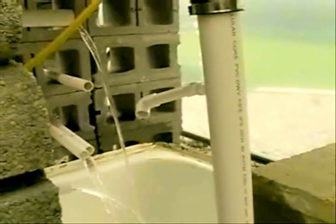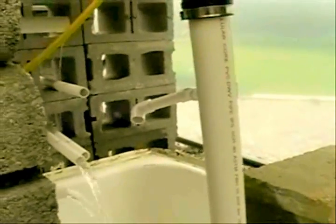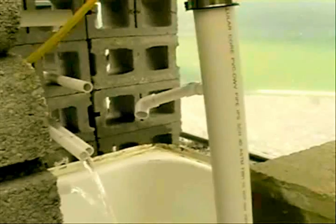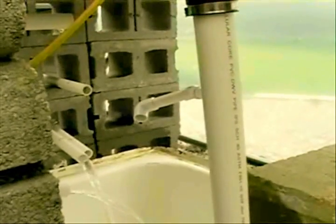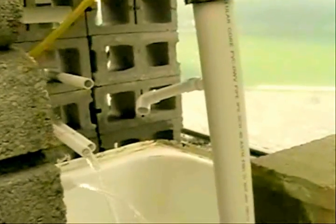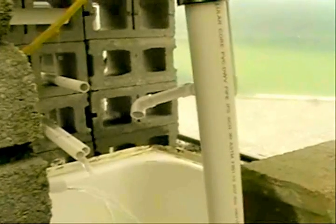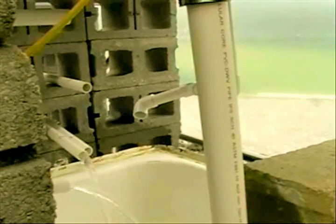This is bed number 13 right here. The water's getting up. We need to add a little bit of gravel, but it should be starting to siphon. It's the crooked one down there. You can see a lot of them are siphoning, and pumps are running. So bed 13, all that crookedness on there is to help it to get a siphon. That's where we've had some trouble, with that bed. Everything else siphons, fills up good, siphons good. 13's been our problem. So I bought a couple 90-degree elbows, one to come out right there, and then another one right there, and hopefully it's going to do it while we sit here and watch.